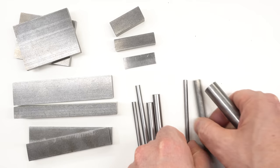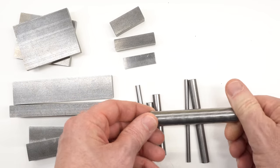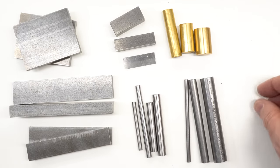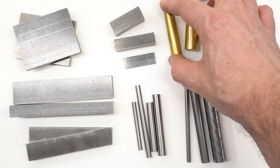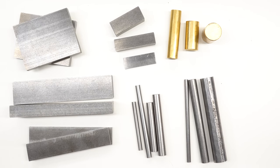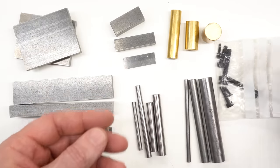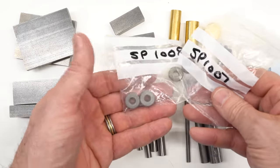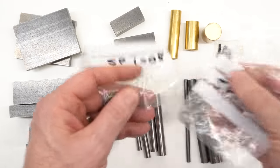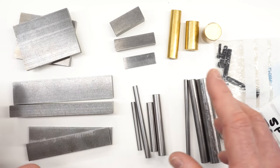There are pieces of what the Brits call silver steel - in the US we'd call this drill rod - mostly for pins and parts that don't need to be turned. For parts that do need to be turned, they've supplied what they call FCMS or free cutting mild steel. I have no idea if it's a leaded alloy or lead free - we'll see how it cuts. There are also brass pieces for the nut, trunnion and various bushings, a bag of hardware screws, and I also picked up a straight and a diamond set of knurl wheels.